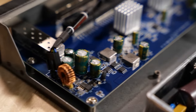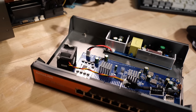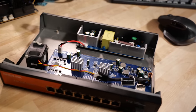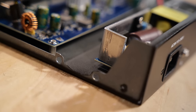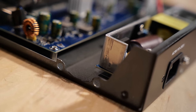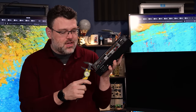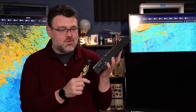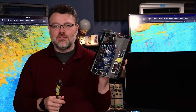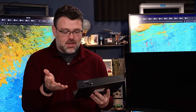Solder in the two-pin header next to the choke, which also runs quite warm, then I'm using a Noctua resistor cable — a four-pin resistor cable — into a standard 1U rack mount fan. There are mounting holes at the side for a 1U rack mount fan, but clearance is limited. The fan size is 40mm, standard 1U, but the depth you're working with is only about 21-22mm — I'd go with 20mm thickness. I hacked in an industrial fan with the Noctua resistor adapter. It's good enough, though it does mean it's not perfectly silent.